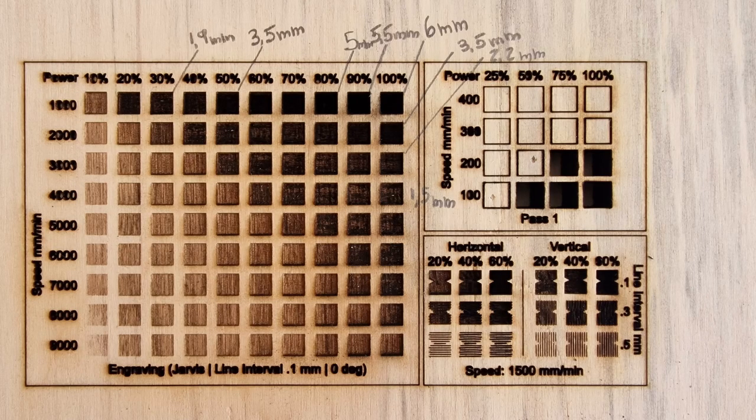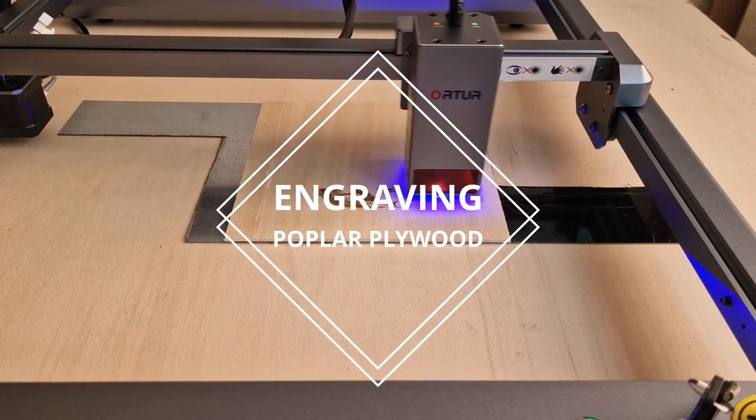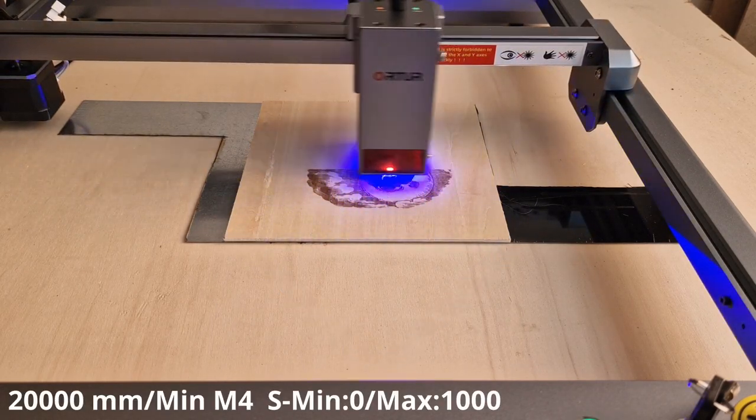So here you can see the depth of the cut and the color and depth of the engraving. We try to engrave an image using the maximum declared speed of 20,000 mm per minute, and the results are amazing.